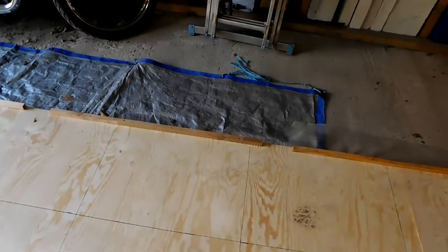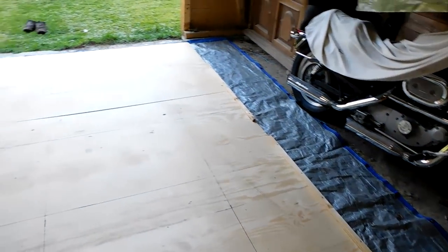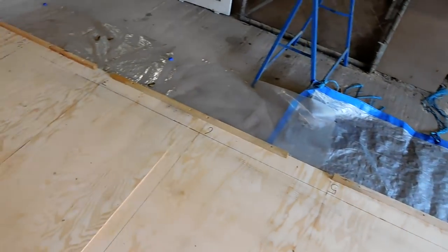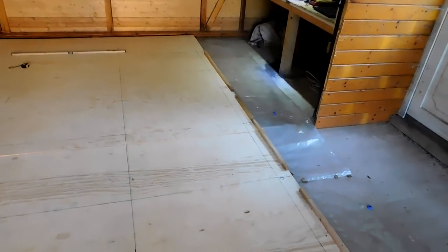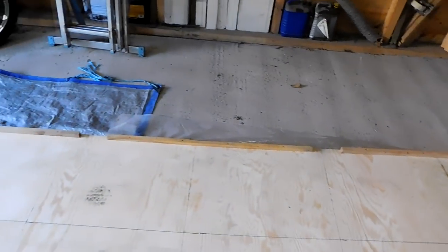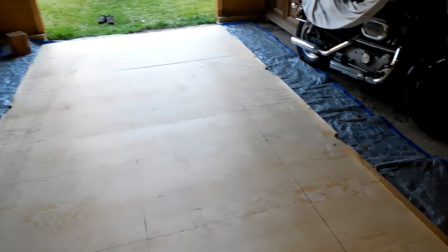As you can see, the boards are fixed together with battens along the edge. And as I mentioned earlier, it's an idea that I got from Pete Hill, I believe, from the Building Badger book. I've used WBP ply for the lofting surface so that later on I can reuse that ply in the actual boat construction.